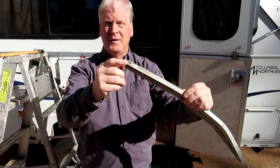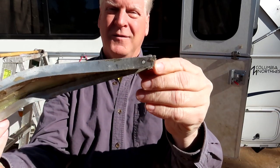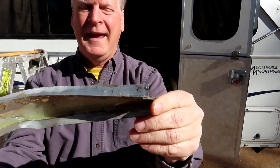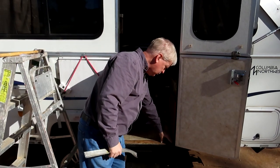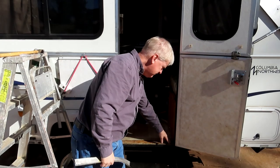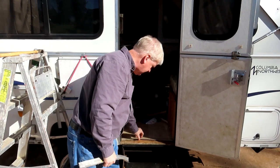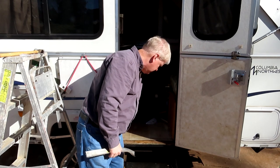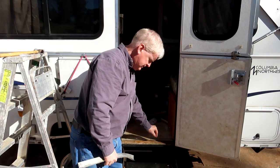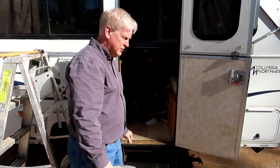And so I had to take that off with some destruction. It's on with two little rivets, one on either end, so we had to pry that off to get to the wood. Just this one side is soft. It's not rotted through or anything, but it's pretty soft. We're gonna cut back the linoleum and put in a new threshold, and put some wood hardener and protector on that and try to keep it from getting crazy.